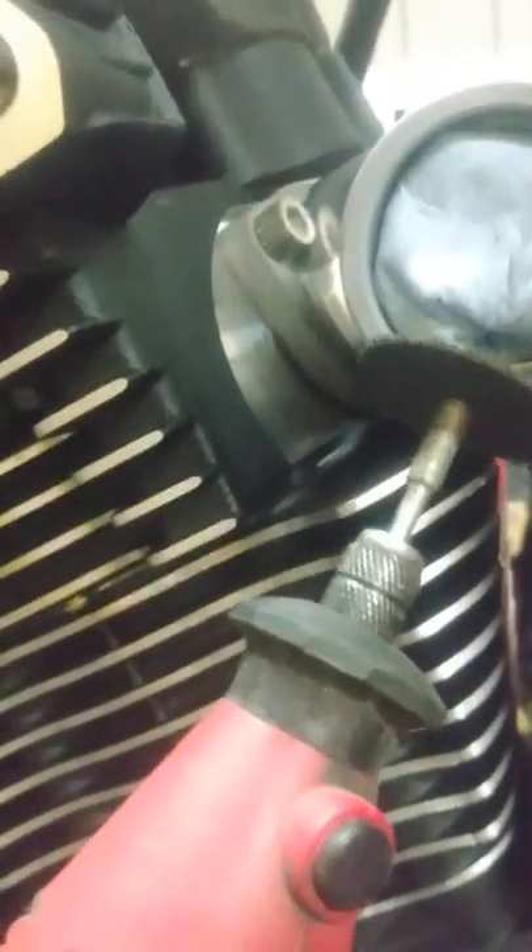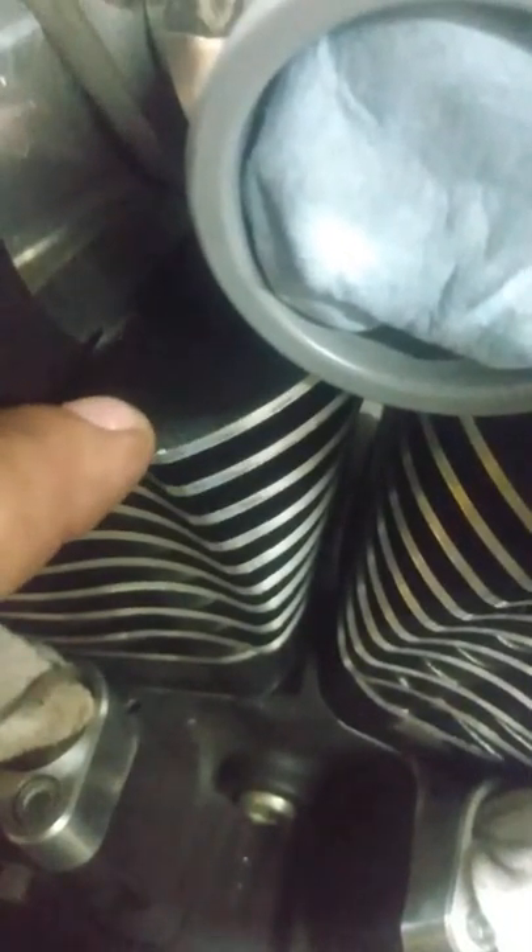So my option right now is I'm going to take this Dremel tool here, this cutoff wheel — my cheap little Dremel — and I'm going to cut them off. I'm going to trim them down a little bit, three eighths of an inch or so, just that corner. Just going to lop that corner off a little bit and see if that will take care of it. They come out kind of far. It's not going to hurt the cooling any, it's not going to affect that, but everything will then fit. I'm hoping I don't have to go into the second fin, but if I do it should not be nearly as much.